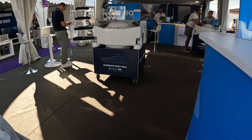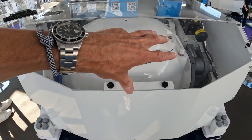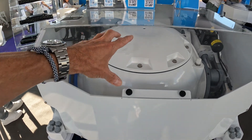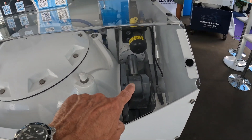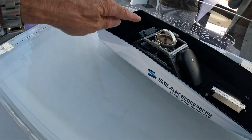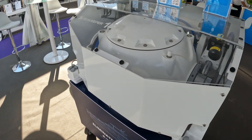That is what a Sea Keeper does. How it works in very simple terms: there's a very large gyro inside. It's in a vacuum to remove air friction — like when you're in a car and put your hand out the window, that's effectively air friction. The vacuum allows the very heavy gyro to spin as quickly and freely as possible. Here you have the hydraulic actuators working very quickly to move that gyroscope to counteract the boat's movement — when the boat rocks one way, the gyro goes the other way to counteract and restore balance. As you saw, it works incredibly quickly.